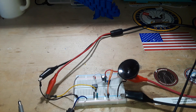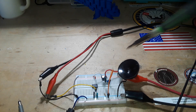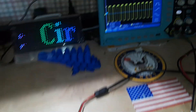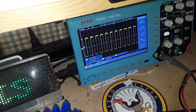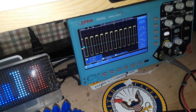Now I'll power up the LM386 and send the input signal in at 440 hertz again. You hear how low that is? I can adjust that. If we come in here and probe that signal and bring it up to the scope — there we are — we'll put it at about 50% gain. You can see our voltage peak-to-peak is 9.2 volts. As I turn it to the right towards ground, it goes down.